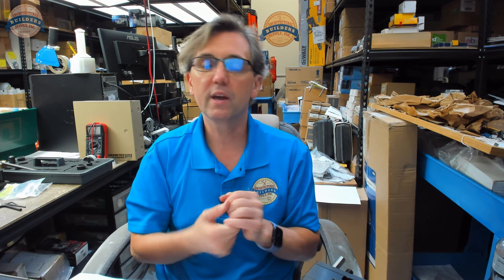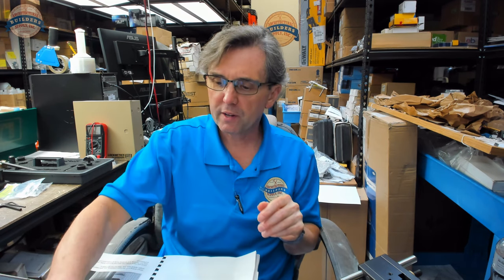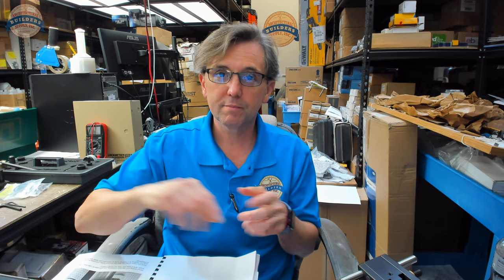A slow, steady, moderate amount of force, let the tool do the work. I was told that when I was very young, and it just turns out that it's the best way. Don't push it too hard, the bit will heat up, and it will become ineffective rather quickly. Just let it do the work. After you become attuned to feeling the bit, you can tell when it's advancing. Anyway, that's something that comes with experience, and it comes with not wanting to spend more money on cutting tools.